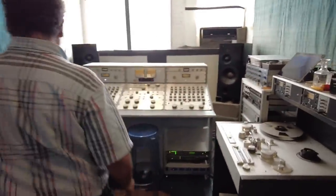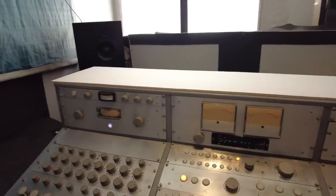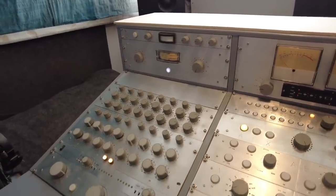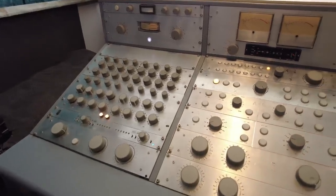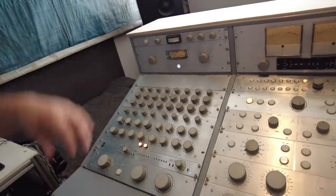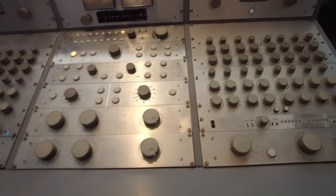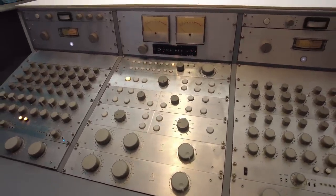You could use it in sections, yes. What it replaced was a Neumann SP 75 console, which was also an A/B path console. But the A/B path consoles that Neumann made were very limited in facilities. You'd have two sets of the Neumann cassette EQs, two sets of level adjusters, but everything else was shared. So it's not really very flexible for a modern mastering setup. And everything in here is old-school discrete electronics? Nope - I use a lot of IC op amps. I like IC op amps.